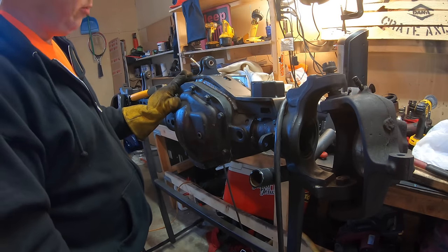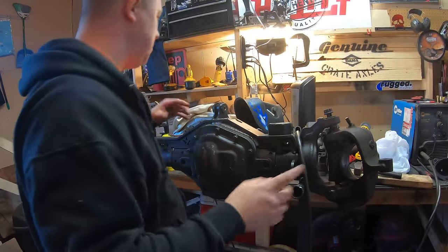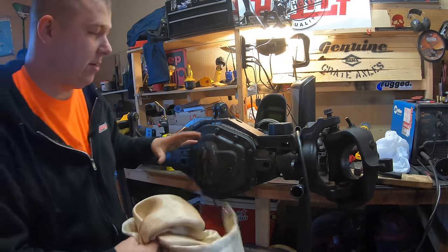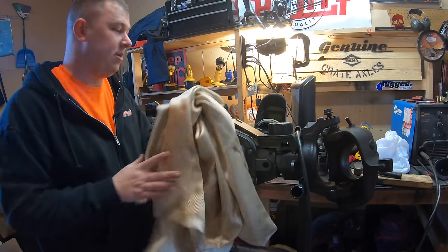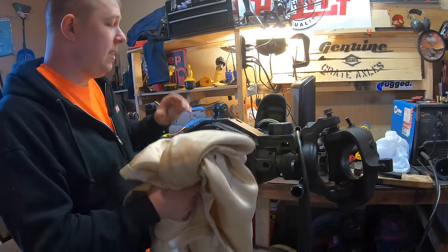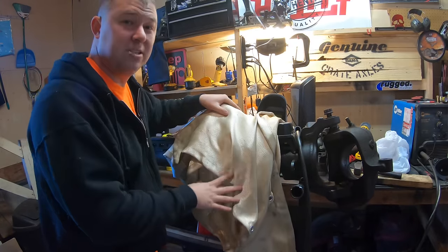I'm going to go ahead and turn off the camera, but hopefully you get the gist — you preheat to 400 and then slowly bring the temp down evenly. While this is slowly cooling down, let's talk. A lot of people ask why not just use the welding blanket to wrap it up. This is a fiberglass welding blanket — you can get them at Home Depot, online, Amazon, or Harbor Freight for about 20 to 30 bucks. Some people will make this weld after they preheat it and then wrap it up nice and tight and just let it sit for 12 hours to really slowly cool down.